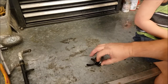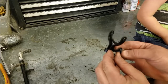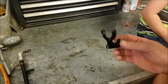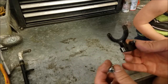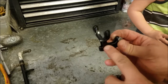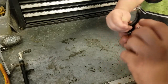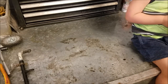As mentioned earlier with the pivot pin — the pivot pin goes through the little cradle shifter just like so, and then allows it to pivot as you shift gears. A lot of people, when they're changing their oil, will pull this out on accident without knowing. And then they send me a message: 'Oh, I pulled this out, what do I do?' If it goes back in, you're fine. If it doesn't, get a little awl or a nail or something and push this around until you can see through it, then put the pin back in and you'll be fine. All right, everybody — I'll save those parts in case I need them, which I probably will at some point. Hope you enjoyed how to take apart your lower unit, and I'll see you all next time.